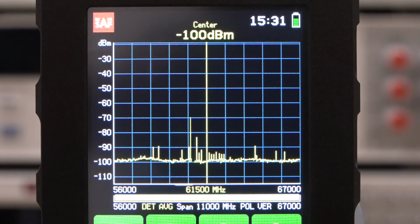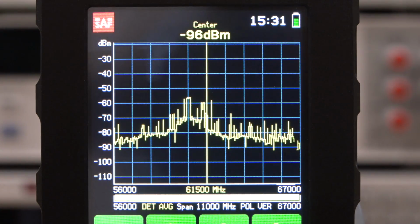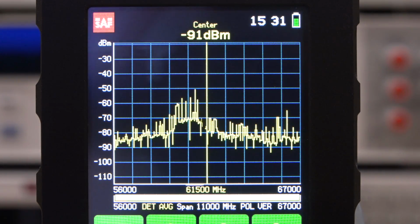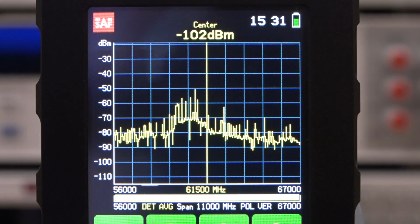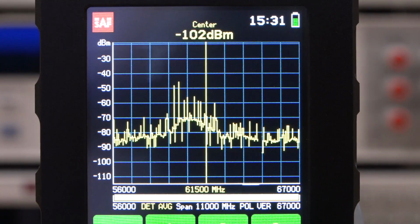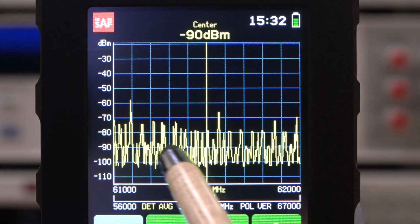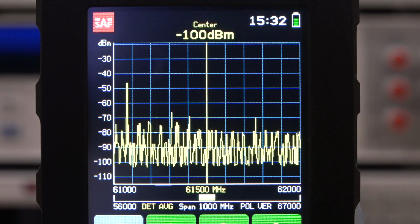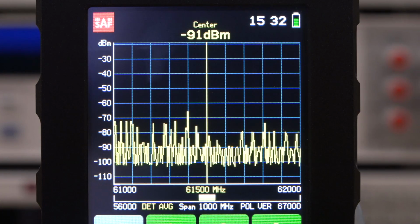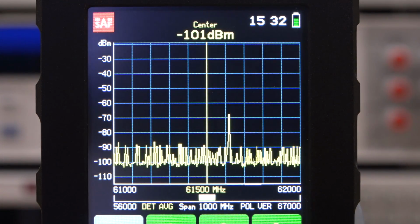And once the handshaking is established and the signal actually goes across and a link is created, we can see it then starts just flooding the spectrum, jumping all over the place, getting all the different bands sorted out. Now 60 gig is a quite broad band. It's channelized and it's going to jump back and forth trying to find the best link. But if I do a minimum span here, you can see some interesting characteristics, and it looks like occasionally these peaks that you see are most likely for synchronization. So there's a beacon that it sends out so it can find out which beam is the right beam, and then there's a burst of activity which is the actual packets being sent, and you can see the power goes up and down.